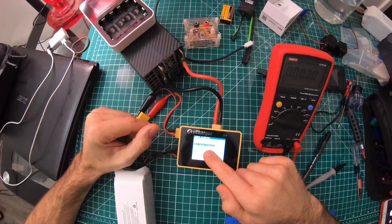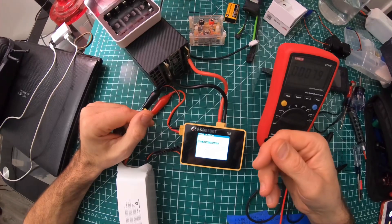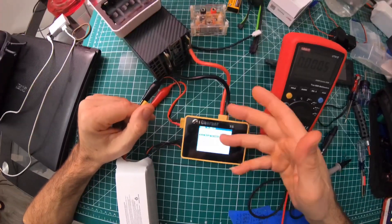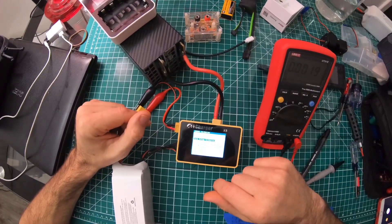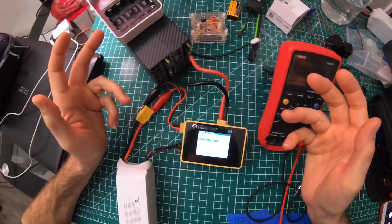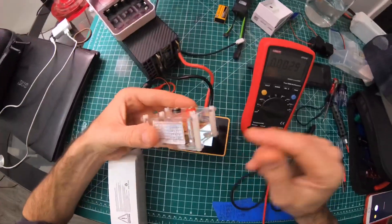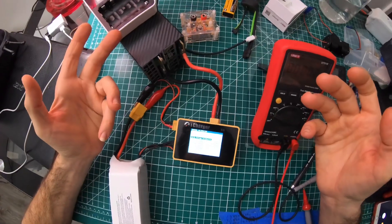You're going to calibrate your output voltage, which is the overall voltage of the 6S pack. Mine was off quite a bit — the iCharger was reading something like 23.50 or 23.53, while the digital voltmeter was reading 23.11.